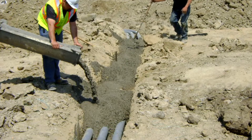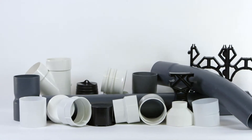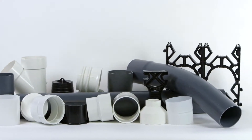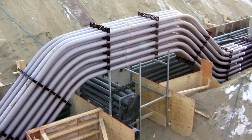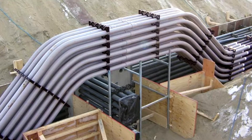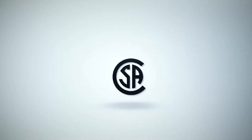IPEC SuperDuct Type DB2 pipe is specifically engineered and quality manufactured to deliver the high impact and crush strength demanded by today's utility companies for underground ducting applications. Made from a specifically formulated compound, SuperDuct can withstand high physical loads while providing the natural flexibility for field bending to accommodate minor changes in elevation or direction. SuperDuct is available in sizes 2 inches to 6 inches and is CSA approved for encasement in concrete and direct burial.